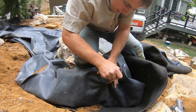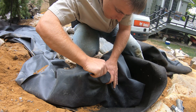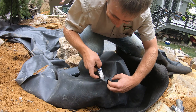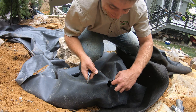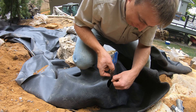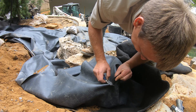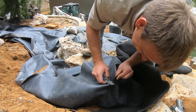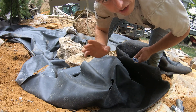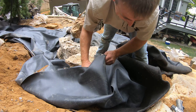I always leave a little bit of slack in the liner. I pick this up on purpose before I decide where I'm going to make my hole, so that when I put it back down there's plenty of slack. What can happen over time with shifting is if you have this thing real tight and the liner would ever settle, it could pull that liner right out of the flange. So I always leave six to eight inches of slack there. Then I just take a sharp knife and cut like a surgeon. This is a fun project — Reynolds is something else. If you ever get Reynolds on your job as a customer, you're in for some good entertainment. He's the jokester of our team, and this customer really likes to be involved in the project. He told her: five questions a day, that's all you get.